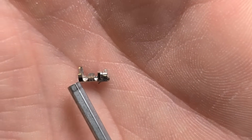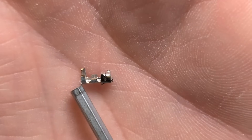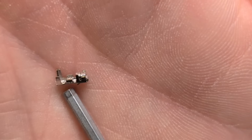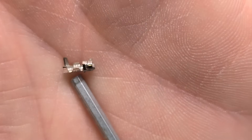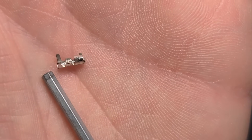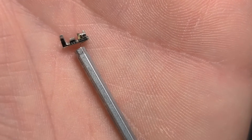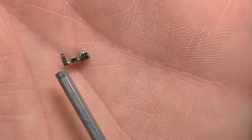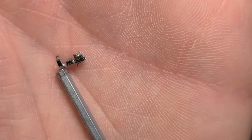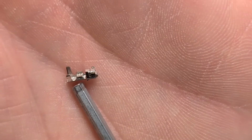The big tabs in the back fold over onto the silicone housing of the wire, and the middle tabs fold over and pinch the exposed wire after stripping. The spacing is really important — you want to strip your wire so that when you push it all the way in, it butts up against the pin terminal and the silicone housing pushes past the big tabs, but not too far into the area where the middle tabs will crimp onto the exposed wire.